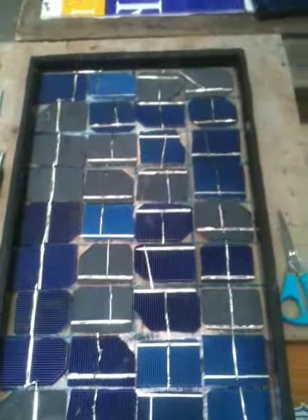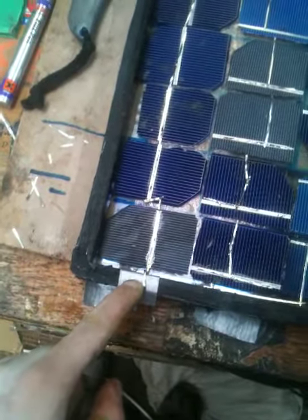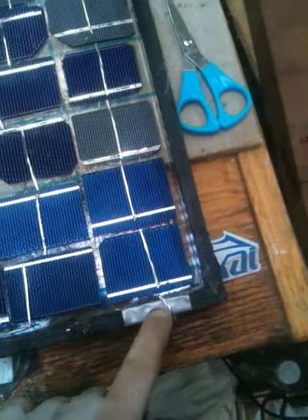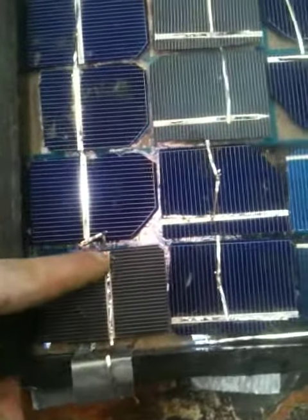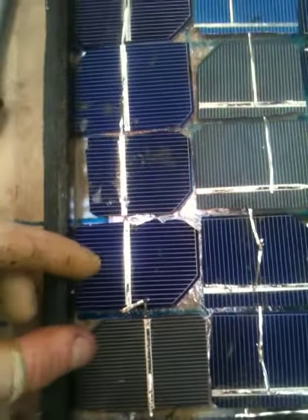So this is kind of like a new design for the solar tree. You've got one output here, and that's coming from the front, so that's negative. And another one over here, so that's positive, because it's coming from the back. And if we start over here, you can see that the tab wire is going onto the front, then one coming out the back, and onto the front of the next one, so you've created your weave.